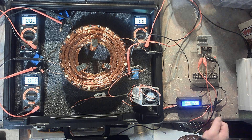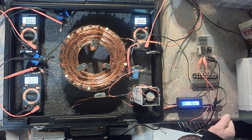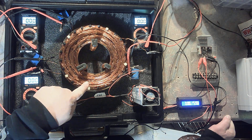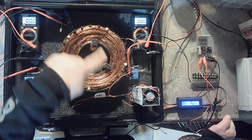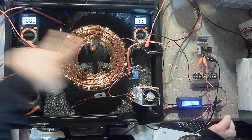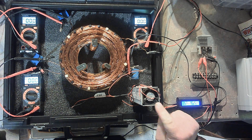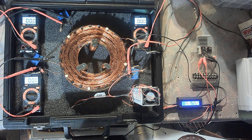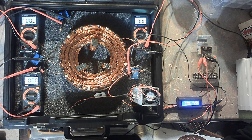Quick video: vortex coil in a case, pulsed 28 volts from a function generator at 880 Hz square wave, 20% duty cycle, through a horizontal deflection transistor to this coil. We're going to pick up voltage on these three meters, plus we're going to light this up and see how many watts it takes to do all of that. In three, two, one...